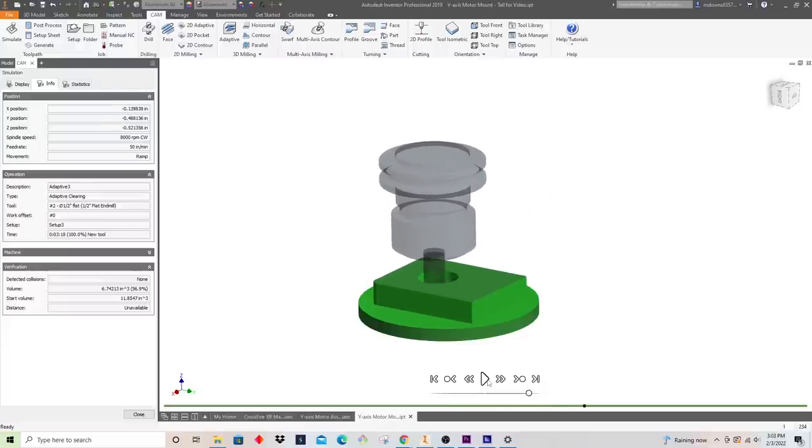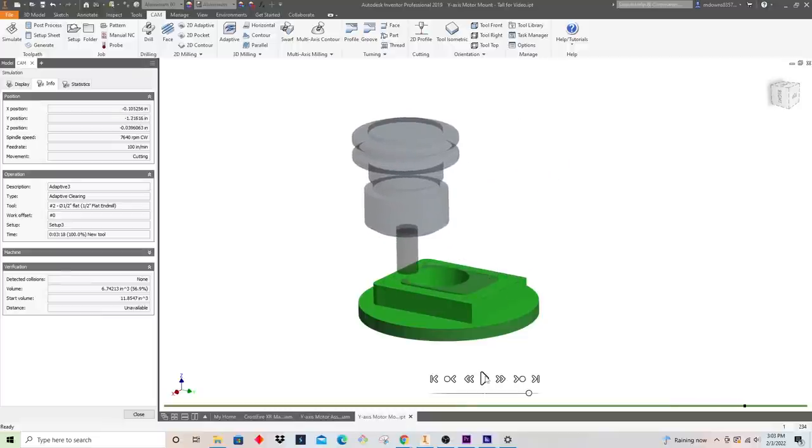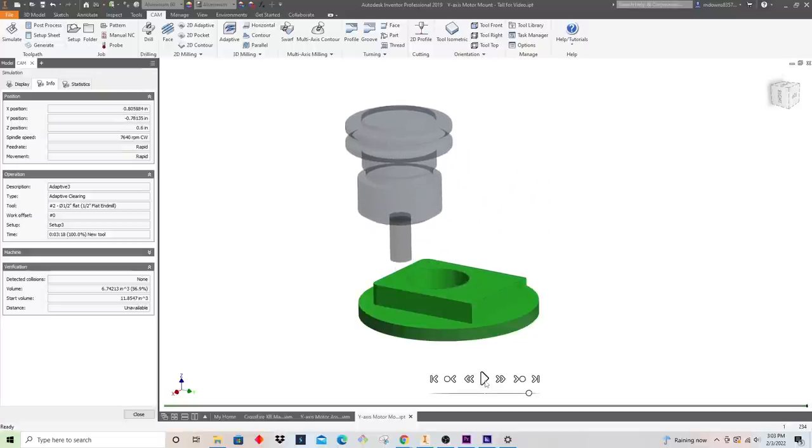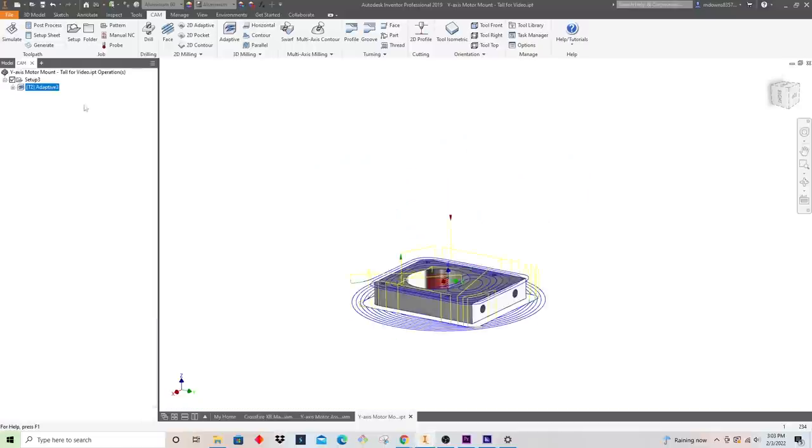Then we're doing that bore, and we're leaving that 15 thou, and then we're cleaning that up, and we should be down 40 here, and we are. Negative 039 thousandths, which, okay, again, makes sense. All right, so that feels pretty good for our rough adaptive facing here.